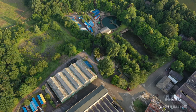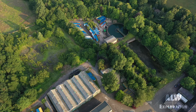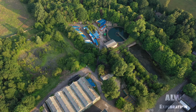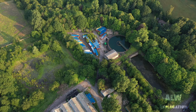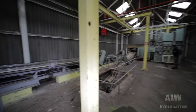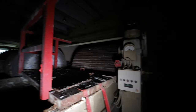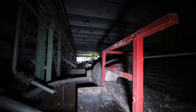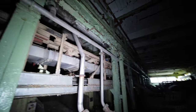Spent digester product was expelled. This was collected and metered into the site waterworks shown here in this drone footage. The digested fibre product was then conveyed into this machine, where excess residual liquid was removed prior to washing. This piece of equipment is called a potcher. Here, the fibre was washed free of digesting liquid.